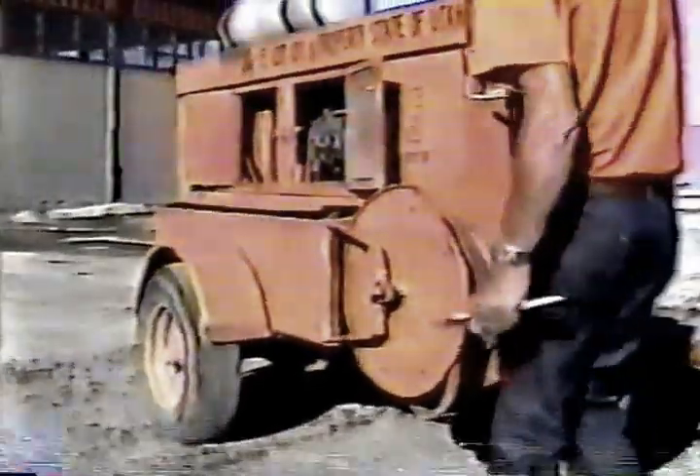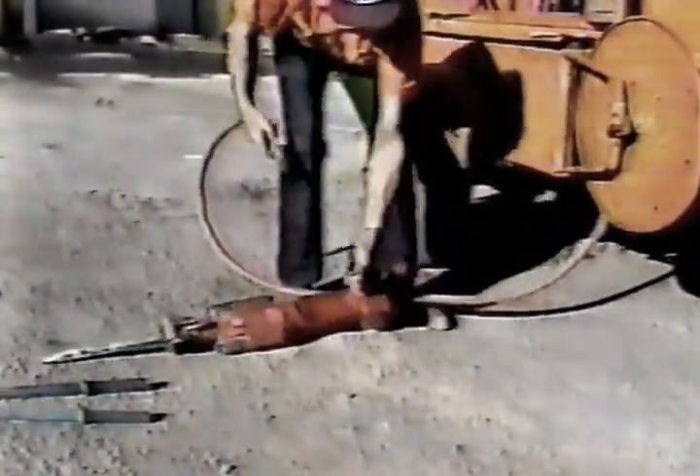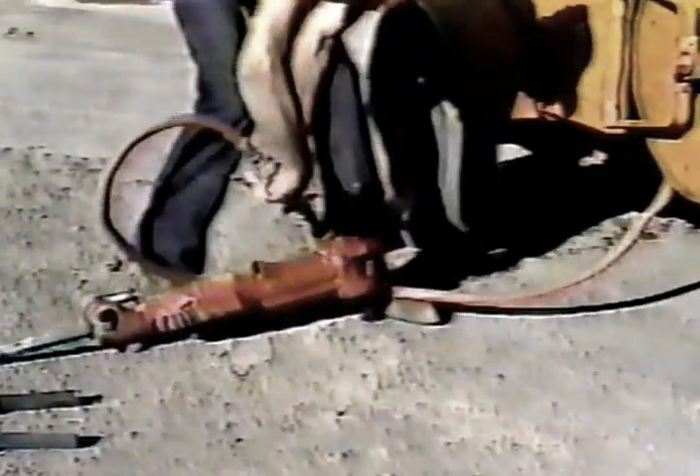Now, hook up. Even though there are several attachments that can be hooked up to the compressor, you can follow this procedure for all of them. For example, when working with a jackhammer, put the bit on the hammer before you attach the air hose. Don't assemble any attachment while it's under pressure. Once you've assembled the attachment, hook up the air line — snap the couplers together and turn them to lock them in place. Secure the couplers by running a wire through the holes. If the couplers come apart, the wire will prevent the air hose from whipping around and possibly hurting someone.